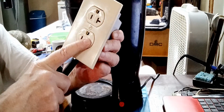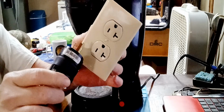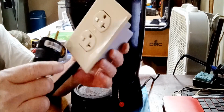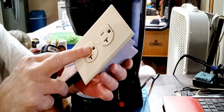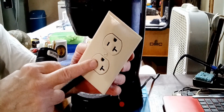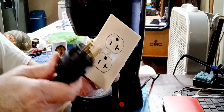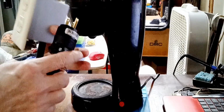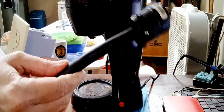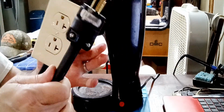Commercial plugs, you can see, 20 amp. And this whole rig, believe it or not, was $21, I think. And that's with the tax. But I ain't gonna have to worry about nothing on this. This is a $3.50 or $4 receptacle. It's not a 50-cent Walmart one. They used to be like 69 cents at Walmart. Good stuff. And SJO cord, 3-wire, 12 gauge. I mean, heavy duty. I ain't got to worry about nothing getting hot with this.